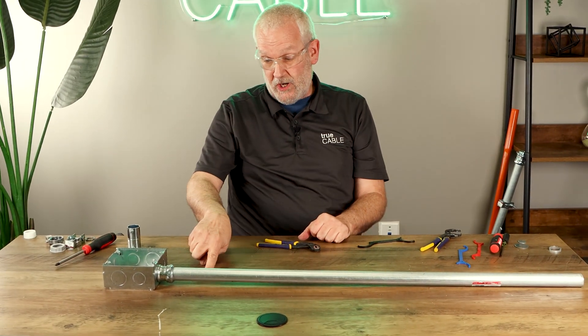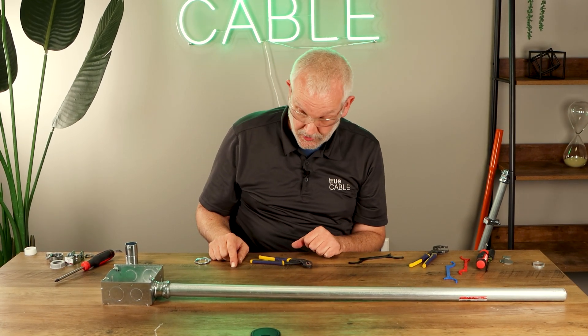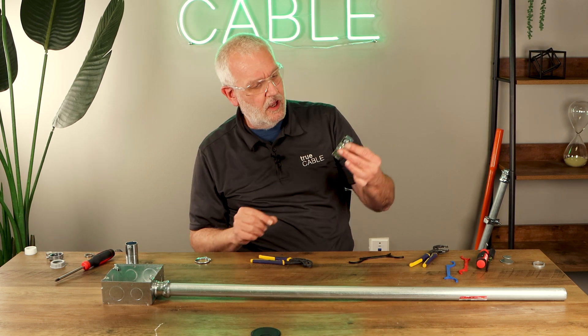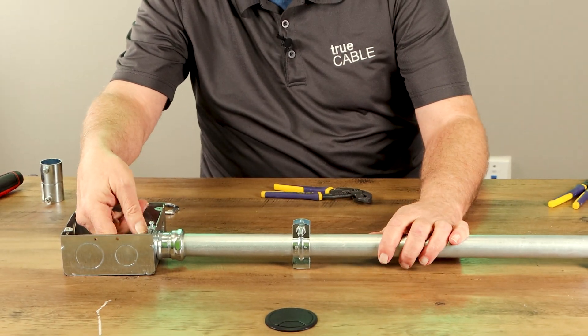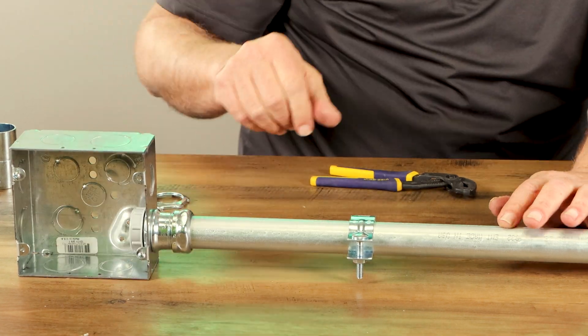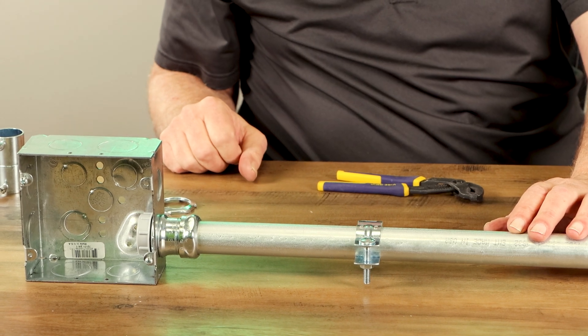You may be able to buy a one-inch offset to do what we did before, or if you're really big and strong you can use a bender to put an offset bend in. But usually what we do is use what are called standoff straps — they hold the conduit at the right height to fit the box. Put the bushing on over the star nut, and this nylon bushing will keep the cable jacket from being abraded while it's being pulled through the conduit and into the box.